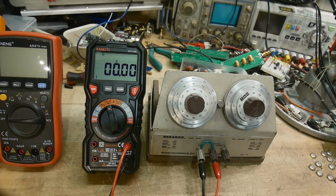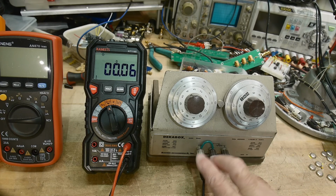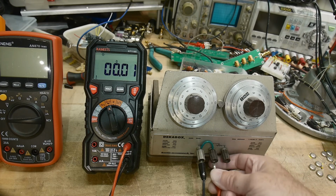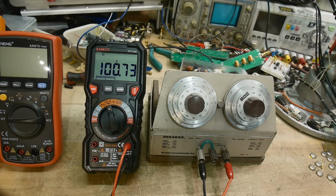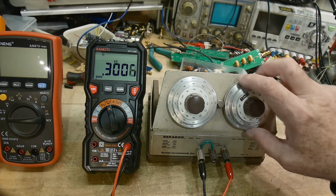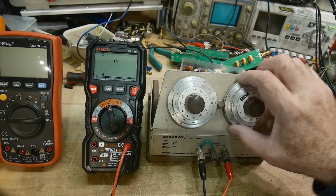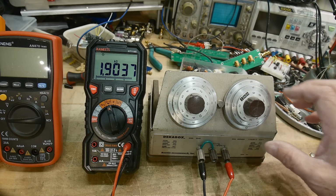All right, let's measure some ohms. We'll look at the 0 here. I'm shorting out here, and so we're measuring that. So there's no drop in the leads here. So we'll go over to the box. We have it set at 100 ohms. 200, 300, 400. Let's do 19. Let's see what happens when it does that. Yeah, we get all the digits. 1.9K. All right.